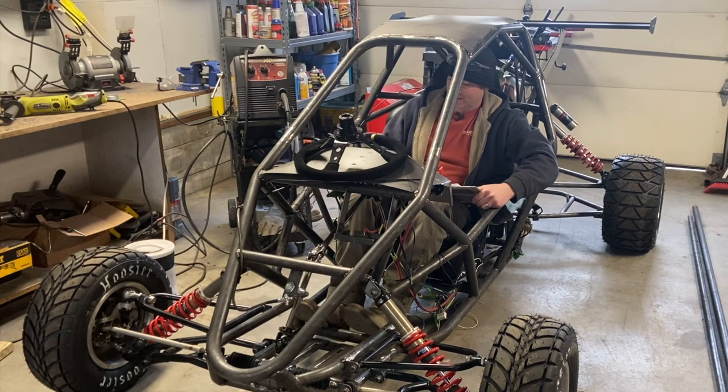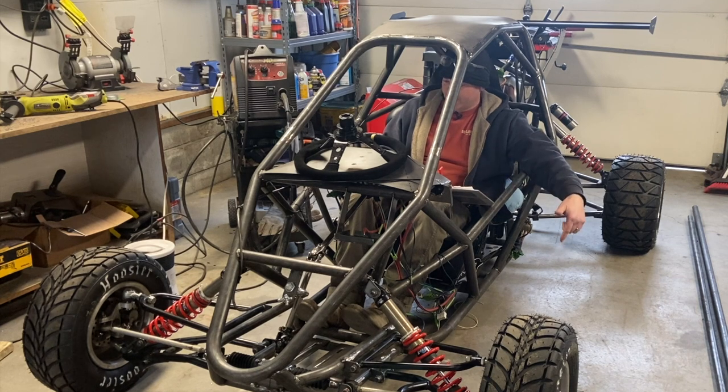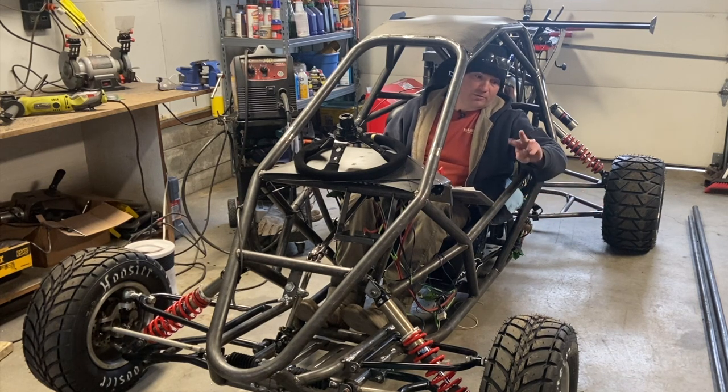1.3, hooking protection. A side protection shall be mounted between the wheels long side. The protection shall be made with a construction of steel pipes or tubing, 30 millimeter or 1.25 inch diameter, and 2 millimeter thick or 0.079 or up, and be secured on both sides, covering a minimum of 60% of the length of the wheelbase. The space between the construction and the body structure shall be completely or partially filled to prevent a wheel from penetrating. Both ends of the outer pipes shall be plugged in the same material and be put in height with the center of the wheel hub plus or minus 50 millimeters, or about 2 inches.